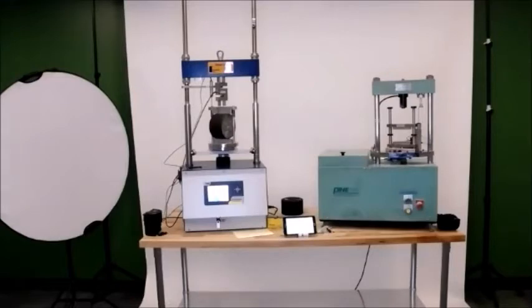Well, certainly in terms of the ideal CT, yeah. Todd, you've been running some of these tests. You're doing 6-inch, aren't you? Okay, you can hear me now? Yeah, go ahead, Todd. Yeah, we did our tests with the 6-inch, and I believe we used, and Eric, you can jump in, the calculation provided at the NCAT course for determining the weight to get to your void content, and it seemed to work pretty well.